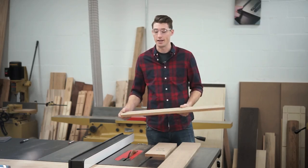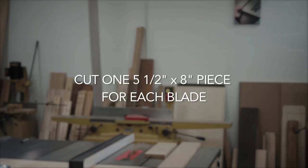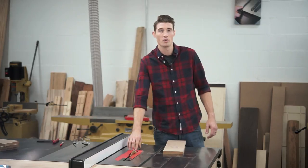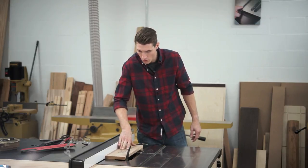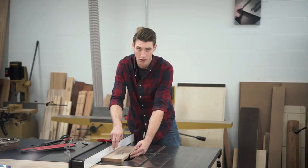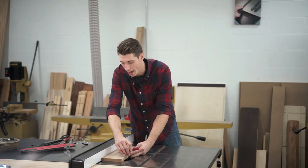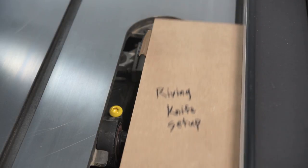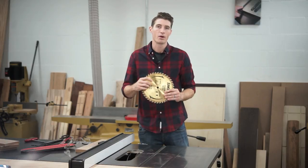We're going to go ahead and cut the other test pieces — you need one for each blade, and you're going to cut them at eight inches long. We can set these pieces aside for now. Now I'm going to remove the blade so that I can calibrate the riving knife. We're going to take the riving knife setup board and slide it up toward the riving knife. We loosen the bolts that secure the riving knife in place, apply a little bit of pressure on your riving knife so that it's tight up against this board, and then tighten it back down. The riving knife is now tight up against this board, which means it's perfectly calibrated with the fence side of the blade, which is right where we want to be.